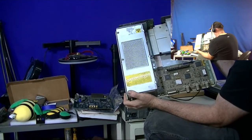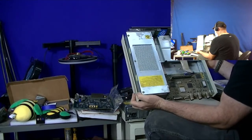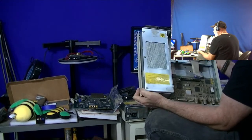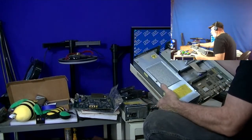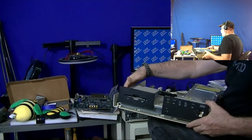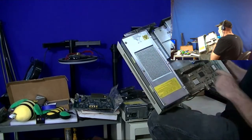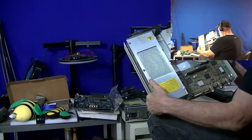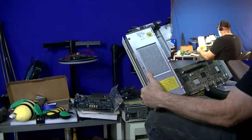The 186 CPUs weren't used for many PCs out there. There's a few, but since it had added support chip functionality on there, it wasn't used as much. There's also the 188 CPU, and that probably helps a little bit with running the diskette drive. It's effectively a PC diskette drive that's on there. And there's even what they use as the diskette drive controller for the PC here, or a later revision, the Intel 82077.